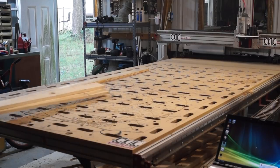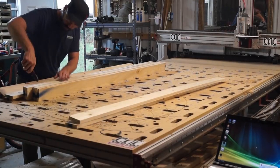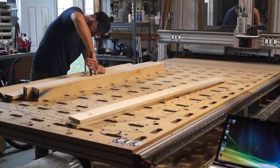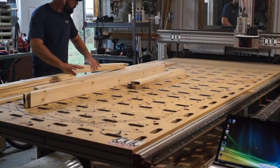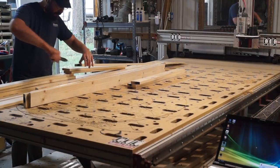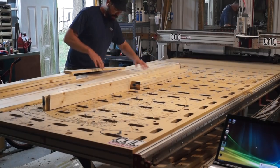It's time to start constructing the body of this light. I used cheap pine — ultimately I think this would look much better with walnut or maple, but I didn't want to spend a ton of money on wood for this experiment. I decided to do kind of a butcher block look with cheap one-by-three pine from the local hardware store. I cut a bunch of them in half to stagger them and get that butcher block look, doing a nine-foot-long glue-lam setup. I'm staggering them so you don't end up with a seam that goes the entire width — it alternates, three foot on one side and six foot on the other.